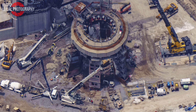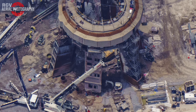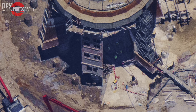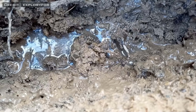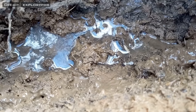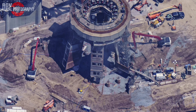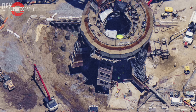The next step in this process was to excavate all of the backfill material that was brought in prior to the installation of the auger piles. SpaceX needed to dig down nearly 15 feet or 4 meters from the height of the original blast surface. Digging this deep puts the bottom of the excavated area roughly 2 meters below the local water table, which creates a bit of a challenge for the construction process. The biggest issue is dealing with the water that will seep in from below the surface, but there is also a possibility of water entering through the sides, which could cause instability in the subsoil surrounding the excavated area. Preventing this required a two-step solution.